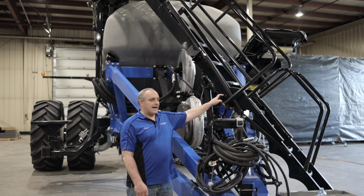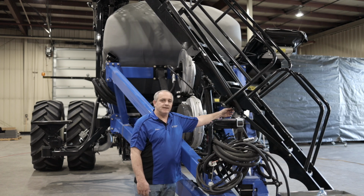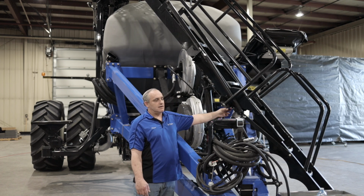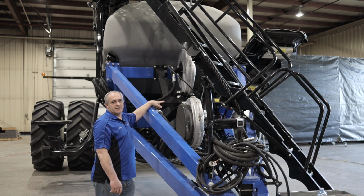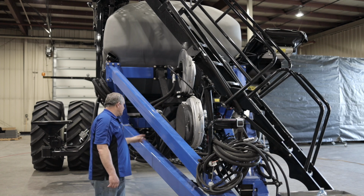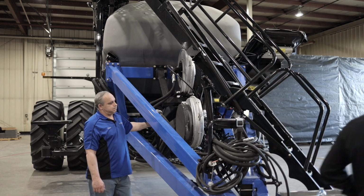Moving towards the back, we have our ladder and our ladder down sensor that will warn you in the cab of the tractor on the display if you do forget it down, especially on the tow behind carts. That's kind of important. Then moving to the back, we have our two fans. Just again, make sure that if you do single shooting, use your lower fan for charging your alternators. Why don't I show them the ladder up so they can see how much clearance there actually is?